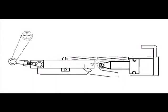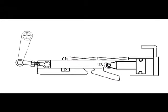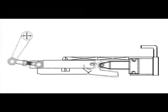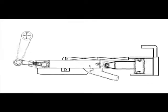Design simplicity is the key to the squaring wheel's advantages over the previous method called the push-pawl assembly. This assembly required a complex set of moving parts working in a reciprocal back-and-forth motion with speeds limited to 300 cans per minute before maintenance became overwhelming.